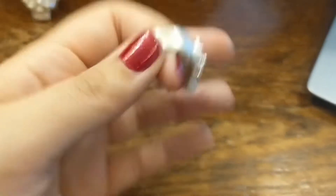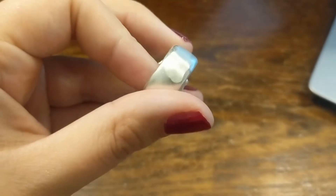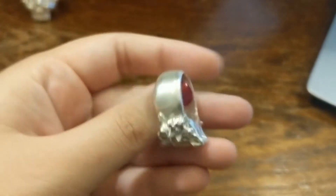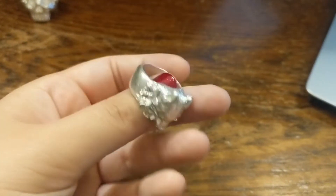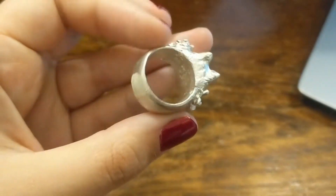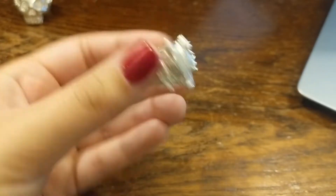I think what I'll do first — I actually got the sprues ground off, just because I wanted to see what that service was like. I just realised I haven't actually explained what a sprue is. I'm going to do a whole other video on the casting process, but basically when you get a casting back it usually has a little sort of metal pipe on it — a little extra bit that you need to take off. It does save me a few hours filing off the sprue myself, but it doesn't look great so I don't know whether I'll carry on paying for that.